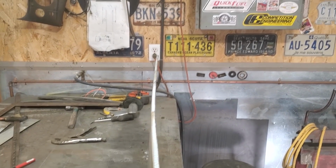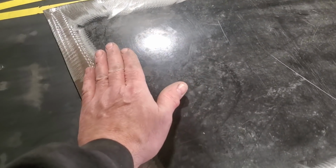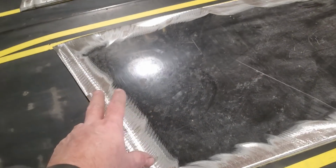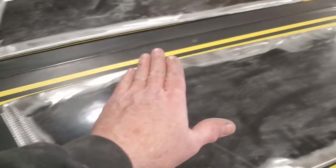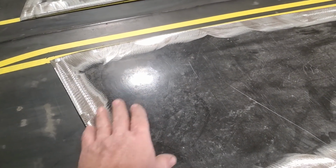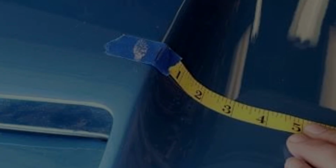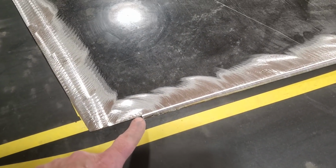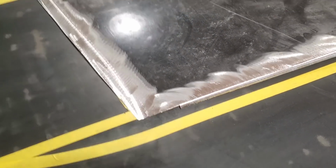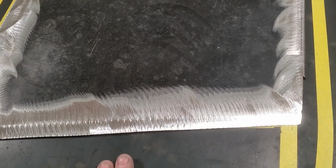But you can see the crown is back in it again there now. Now right here is a crown on the front of this. I wanted to leave that in it. That's the front of the hood section. These scoops come ahead and then they start to tip down, but they tip down just before the opening. There's a roll on them. As you can see, the roll is there, okay? What I did is I cut back 2.5 inches and cut the corner off it so it relieved the roll. So now you can actually see that that is all rolled up.